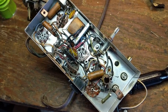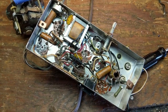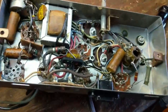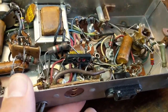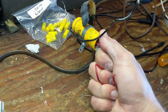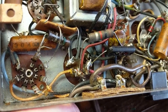Something happened on my phone and I recorded a previous clip, and all it did was give me a green screen, which is annoying because I talked about a few things I did. Let me try to recover: I took the chassis out because the case was pretty badly damaged and I wanted to fix that first. When I flipped this over, what I found was that all the leads of the new cap were actually soldered on top of the leads for the old cap — they didn't take the old cap out of circuit, which is a stupid thing to do, just asking for trouble.